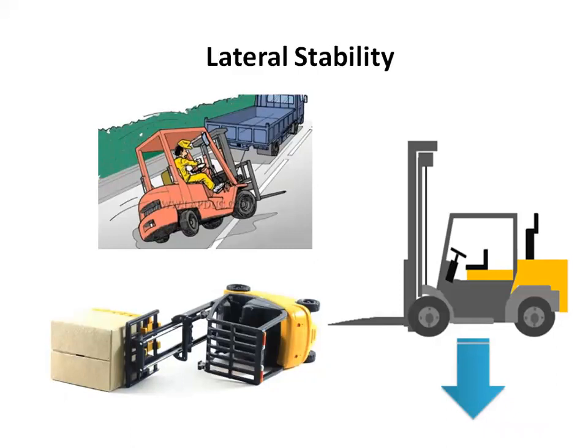That is also caused by the centrifugal force created by the turn. Dynamic refers to the idea that an unloaded forklift's center of gravity can shift outside of the stability triangle as a result of certain movements, such as suddenly starting forward, sudden stops, turns, applying brakes at the same time, or operating on ramps. In order to prevent this from happening, the operator must behave more prudently by driving slowly in such situations.